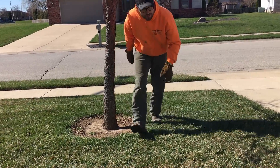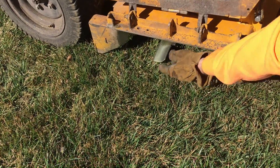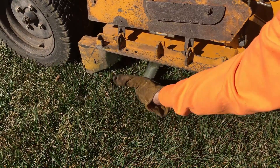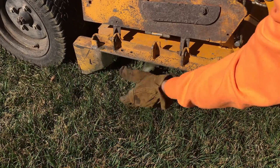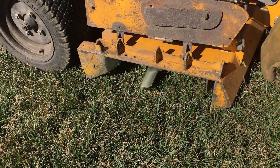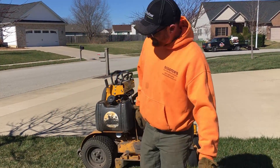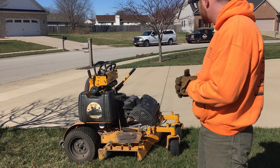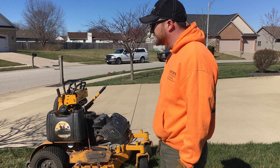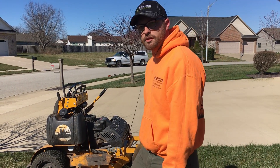So always watch for the deck. Always look where you're going, and definitely keep in mind that this blade is right here at the very edge. It is very easy — if someone's walking by, you want to stay away from them and stay away from everything on this side of the deck that could potentially be caught. You'll cause bad scalp marks and wound things that don't need to be wounded. With that being said, that pretty much covers most of the topics we have for today on mowing. We'll get you out in the field, give you a little time operating these things, see how they work with the joysticks, and get you feeling comfortable so we can mow some lawns. Have a good day.